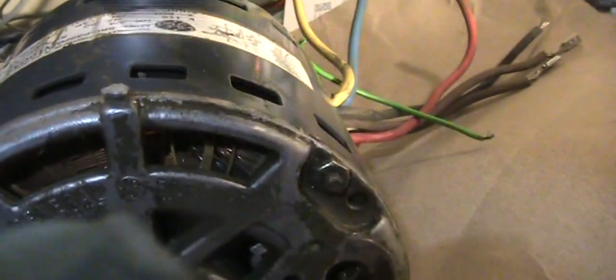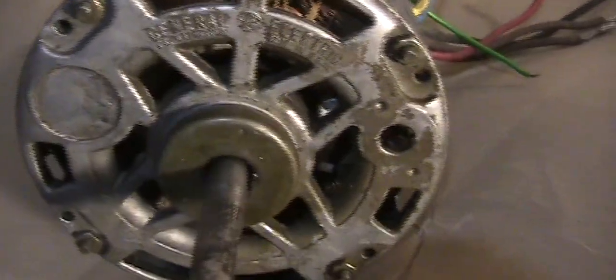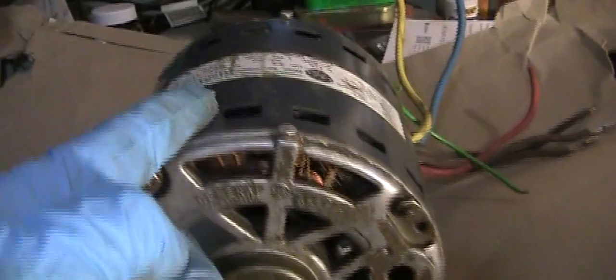And same thing on this one, pry up this way on every single angle slowly, and this part comes out. So after that, you take this out, you put the oil on it, and you press it down. There's no screw, no nothing, just hammer a little bit and this should be good. And if for whatever reason you don't have these 2 oil ports, then you have to take off these 4 screws. You should mark it,